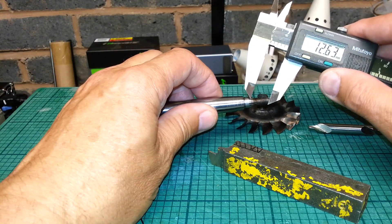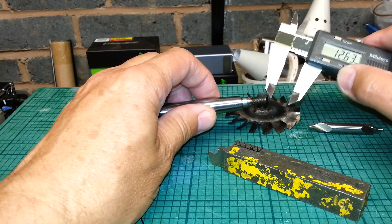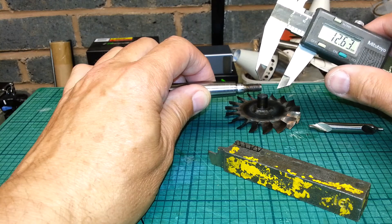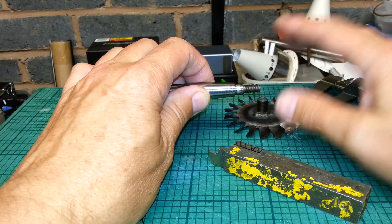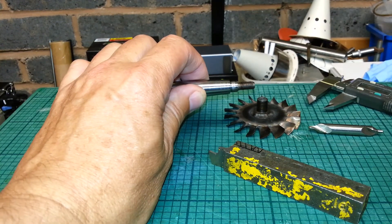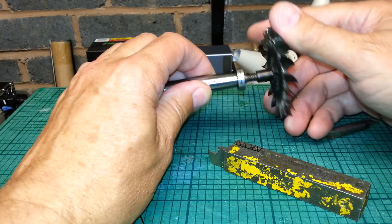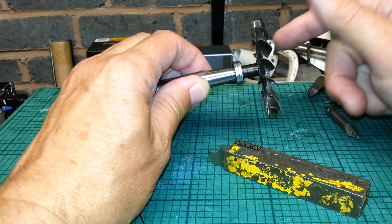When you've tucked that down and skimmed this face using the ball bearing, take the turbine wheel off. While this is still in the lathe, take a good two millimetres off the end of this thread — then it's not going to bottom out in the turbine wheel. When you've done that, put an old bearing on and tighten it up, making sure it's seated against that bearing face. Get a half-thou feeler or something.